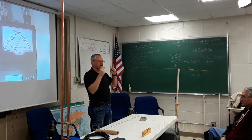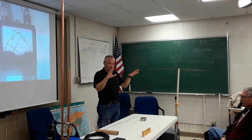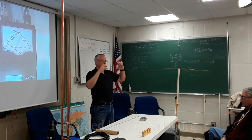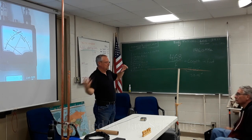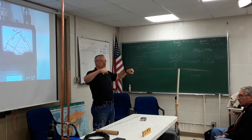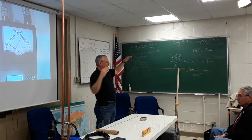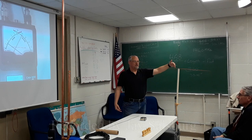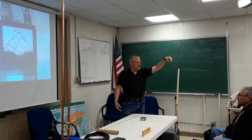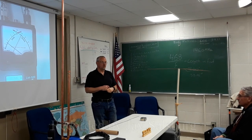Why does it make a difference if the impedance is different? What happens is, it's like a voltage divider. This is probably wrong, but essentially, it's like a voltage divider. You want the power to be split between your transmitter and your antenna, and you want the transmission line to match, so that it's all the same impedance and you have all of your signal being radiated. Because it mismatches, you're going to have a reflection coming back before it ever gets to the antenna, at the connection.